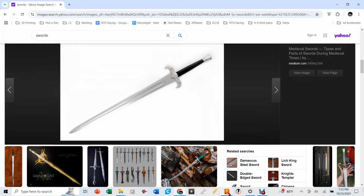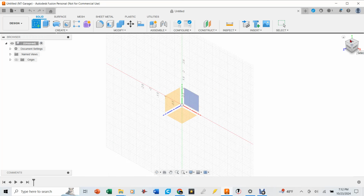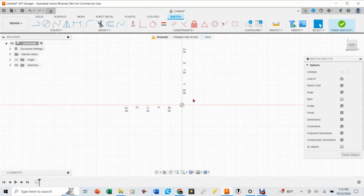We'll go over to Fusion 360, and I use this a lot to make videos of Fusion 360 for the Langmuir Systems CrossFire Pro and the XR. All we're going to do is basically draw pictures. So I'm going to sketch. If you look over here, this says that the Y is up and the X is that way. So this plane is what we're going to sketch on, because plasma cutters cut in the X and Y plane and the Z is just torch height control. So it's really just two planes and then something that controls the torch height. So always X and Y, otherwise it'll be really weird when you try to use this thing.